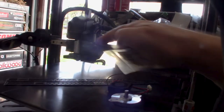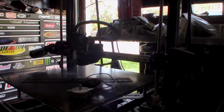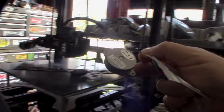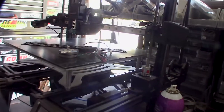This is my custom mini extruder system I made based on the Bondtech BMG extruder. I've been making some new custom stuff — I'll make another video about it — based on this NEMA 14. Take a look at the size difference between the NEMA 14 ultra-light and the NEMA 17 pancake. We're talking tiny. I've got a whole new system based on that.